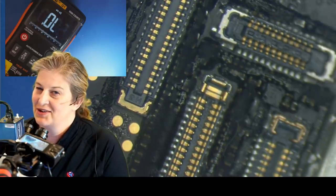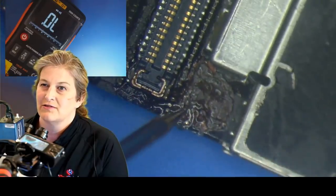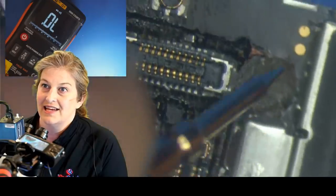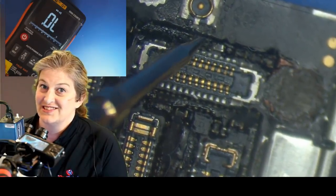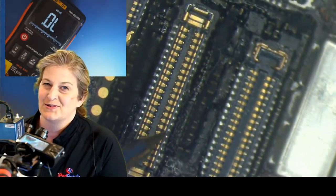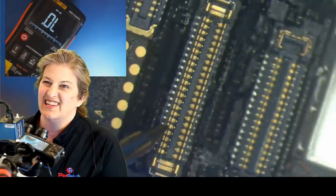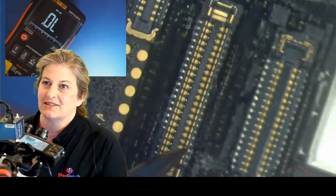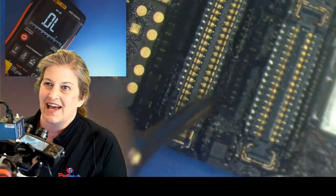So all we really have to do is deliver from the CPU, from our nub, a solid line over here to this pin, which, since there's continuity, will also bridge the gap all the way over to our pin 32. So let's do that, because it's a lot easier to make a jumper out here, maybe on that filter or just on the connector that we're not really using, than it is to get in here with all these guys. They all need to be there.